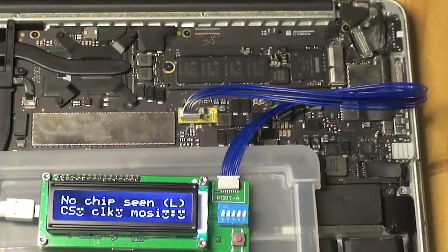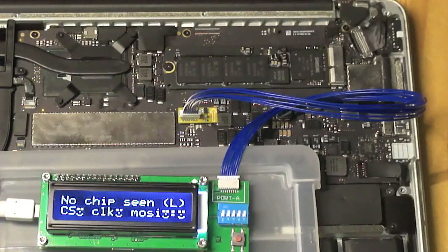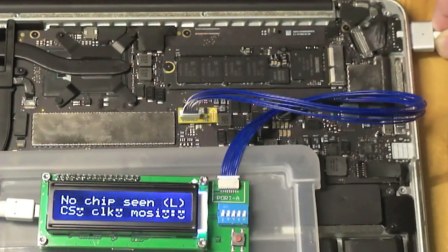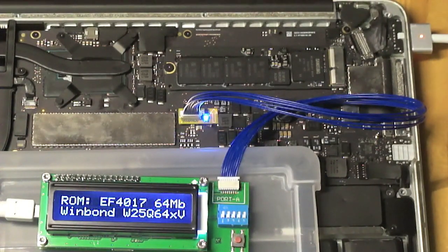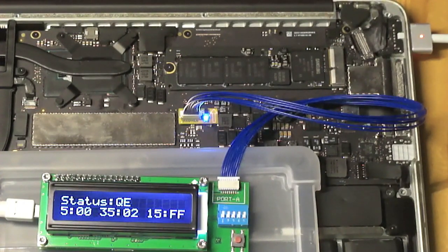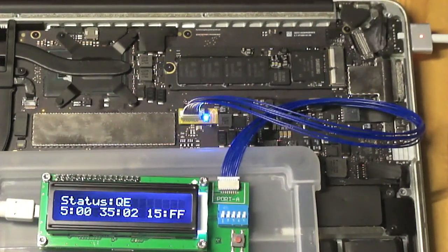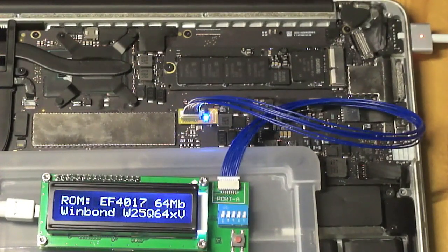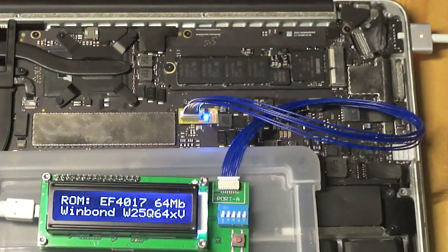As you can see the Medusa says 'no chip seen', so so far it's not working. So we plug in the power cord. When you see the little lights wake up, the Medusa wakes up and it starts reading from the machine. It's important to first read a little bit to see if everything is working okay. In this case we see it's not working okay — it keeps leaping back to 'no chip seen'.